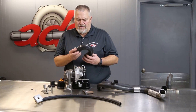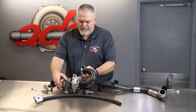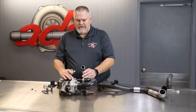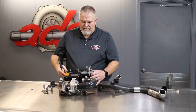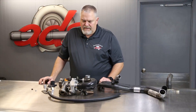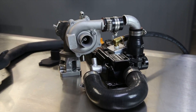This will go on here and run straight back up to the air cleaner. We'll have the actuator sitting over here running that, and on top of the valve cover is the aluminum plate we've made for the breather assembly. Remove this plate, put the O-ring plate on, and the breather tube will run down the side of the engine. This stuff is all ready to go — it'll be a matter of getting the actuator on, getting it adjusted for pressure, and getting the thing put back on the tractor. We hope to film that video shortly and run this thing on the dyno before it goes back to Tim.